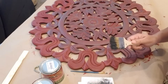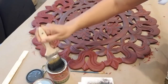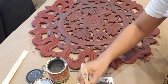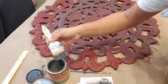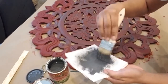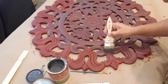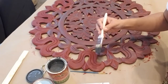Dry brushing is really easy. All you have to do is put a little bit of the milk paint — and you can use other types of paint: chalk paint, acrylic, synthesis paint, all of that. Wise Owl is a really good product to use, Annie Sloan is good, but I love General Finishes. So we're going to put a little bit on the brush, then get a towel and take most of it off. Once you do that, you're just going to lightly feather it on the piece, and it'll give you that beautiful two-tone look.